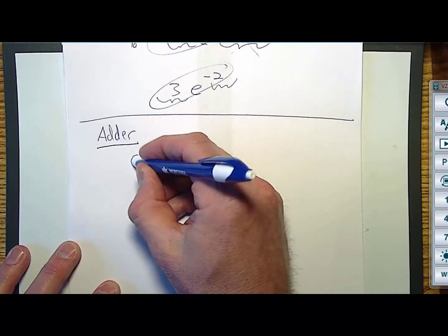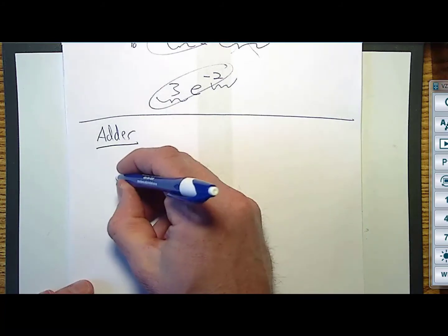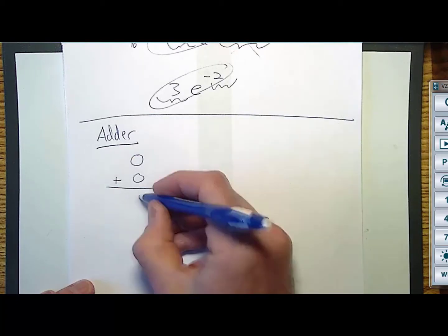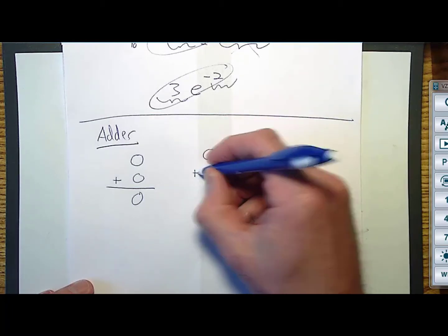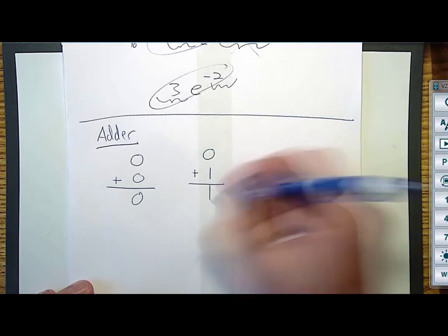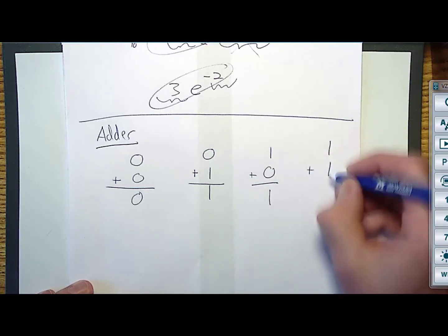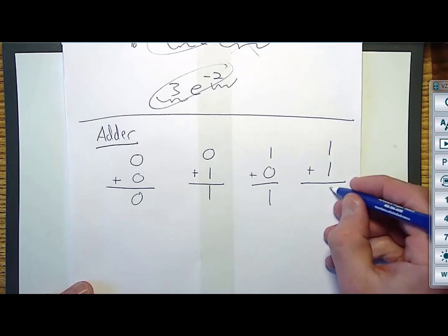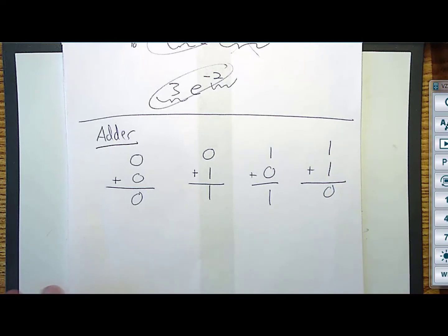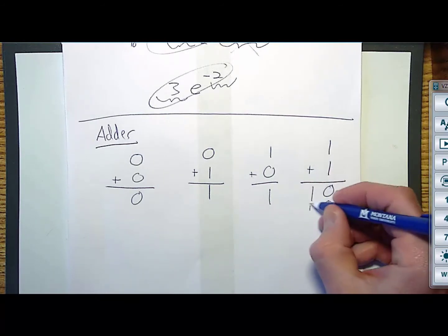So we start off by saying, all right, let's do this. What are all possible sums for adding 0 and 1 together? Okay, 0 plus 0 is equal to 0. Then 0 plus 1 is 1. And 1 plus 0 is equal to 1. And then 1 plus 1, and you go, I'm out. What is it? It's 0. Except you had to bring on another bit position, so it was actually 0 as the sum, and 1 was what we call a carry.